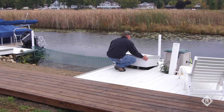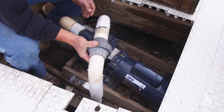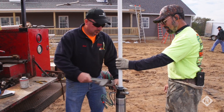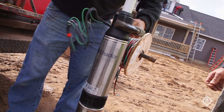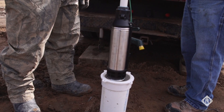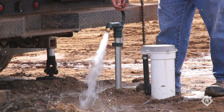I haven't seen an application that we cannot cover with a Franklin Electric pump. This property, we're installing a two-wire, 230 volt, 10 gallon-a-minute pump. It'll meet the needs of the small family starting out, and in the future if they decide to go with constant pressure, this property would be easily retrofitted since we have the Franklin Electric pump and motor already installed.